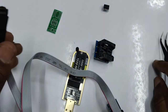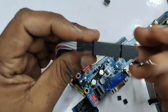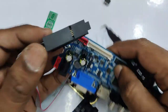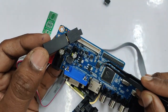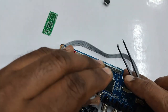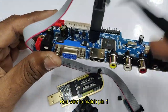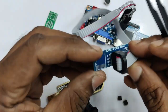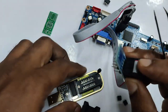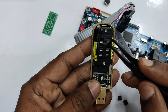This clip can hold the IC easily even without removing it from the board. The main thing to consider is that pin 1 must match the red wire. This is the U11 board with the BIOS memory IC. There is a dot representing pin 1 — you clip it so that the red wire matches pin 1. On the other side of the PCB, the red wire is also marked as pin 1 and connects to the 8-pin ZIF socket.